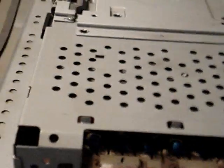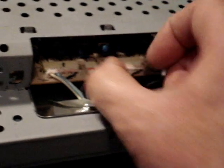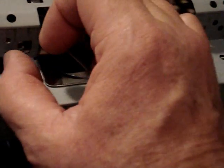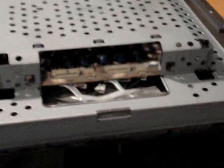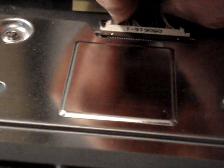Note where the wires go — they just pull out. There's nothing special; just hook your fingernail on them and pull them out. And don't mix them up. That's all there is to that. Now slide the panel — once you've got all the screws out, slide the panel back and remove the connector for the monitor. Just two little tabs on there; push the tabs in and gently remove the connector.